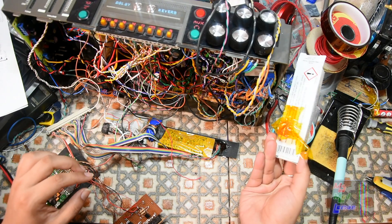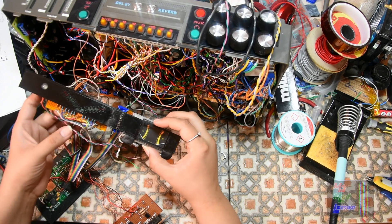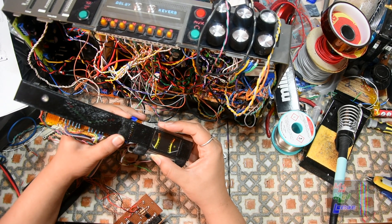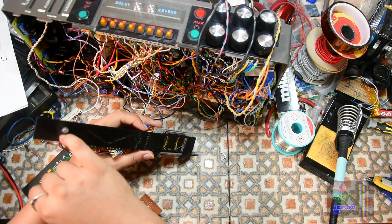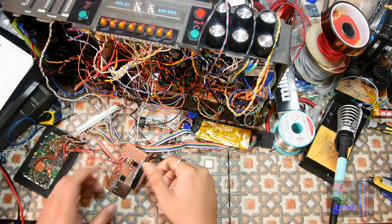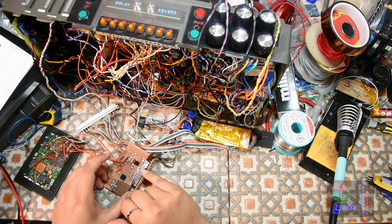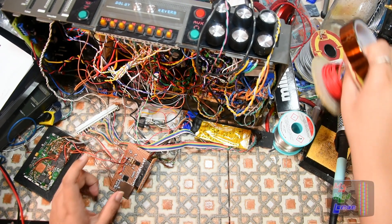For this moment I've used Milliput on the VU faceplate and joined them together with Milliput — I'm gonna have to let that solidify. I've added an LED for the Dolby indicator here, it's a tri-color LED, a retro style tri-color LED, not an RGB one. I'm figuring this one here is plus five volts because of the red — it's a big giveaway — and the ground is just next to it.